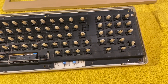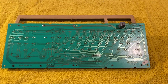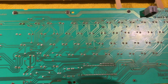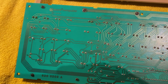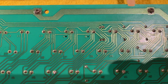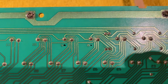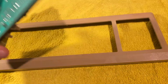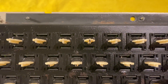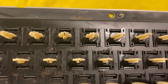First I need to check what's wrong — whether it's the keys or the board itself. This is the solder side of the keyboard. I'm going to check if the circuit closes when I activate a particular key. I've marked keys eight and nine — when I look on the other side, eight appears to be working and nine is not.